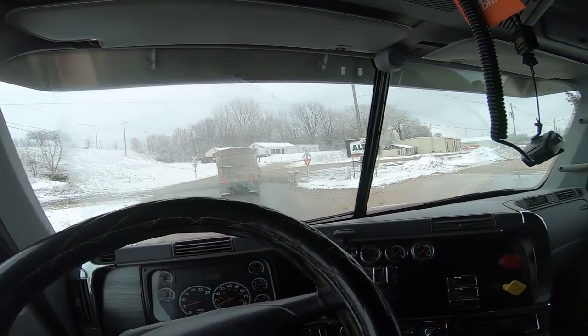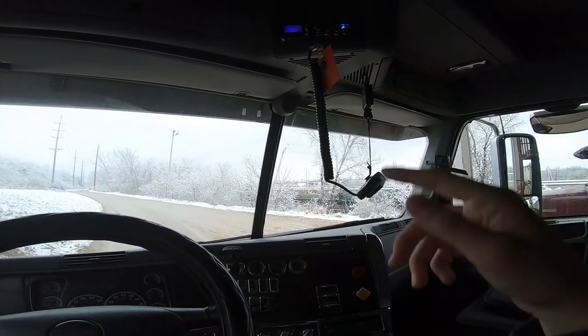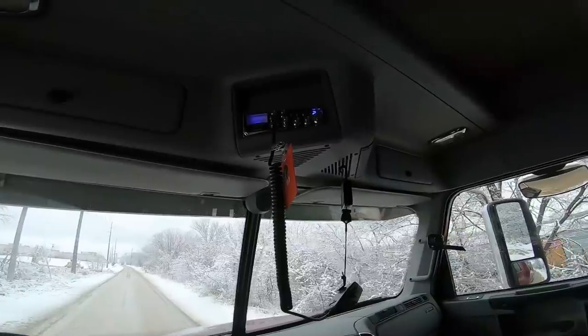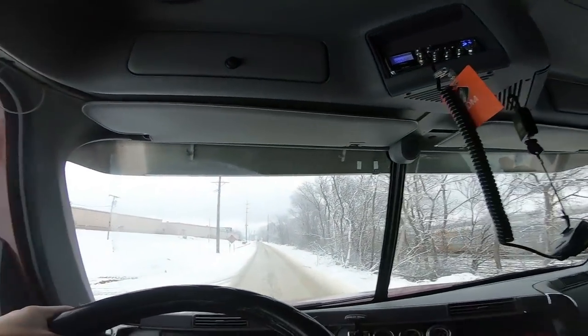All right, we're here. Hope you guys enjoyed that time-lapse. We're going to pull into the lane and get up to the probe shack. Apparently yesterday the line was backed out onto the 30. I give the probe shack my information — what I want to sell my load under — and then they probe me to get a sample. I'm waiting for the probe operator to tell me where I'm going to dump. There are a couple of different places at this facility. She'll say my ticket number, which is 97, and tell me rail or truck side. She's grading my sample right now, and they'll tie that to my scan card. When I scan in with my gross and tare weight, that gives them the weight on my truck. Then they match the grade — moisture, damage, foreign material, and test weight — and tell me how many bushels I hauled and what dockage they'll give me for a final price.